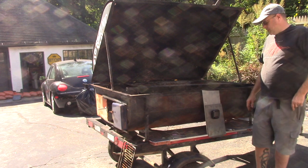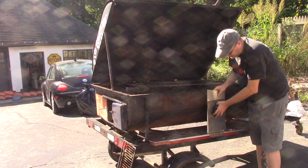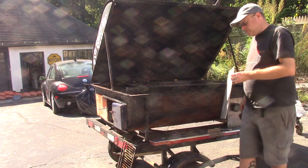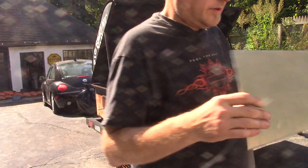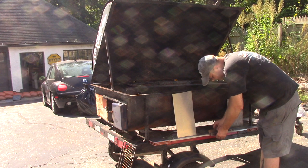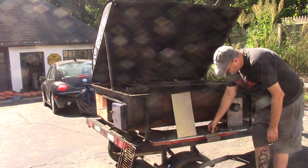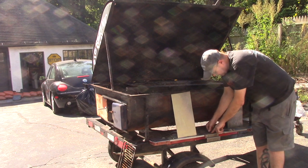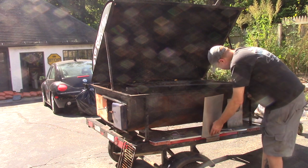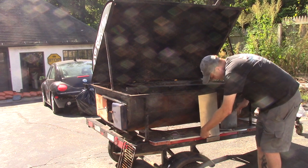I'm hoping the aluminum will grab some of the heat. I'm going to trim it very thin. The majority of the heat shield is going to be a much wider piece of aluminum — it's about .090 thick, pretty thick stuff I use for a lot of different projects. The aluminum is going to be screwed or riveted to the bracket, and then that will be welded to the cooker.